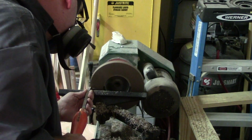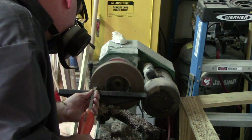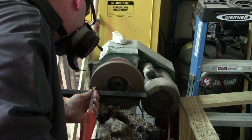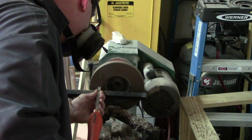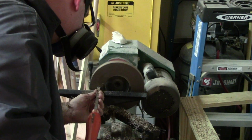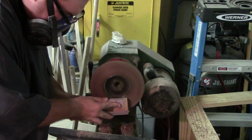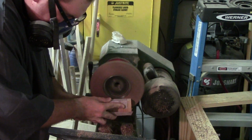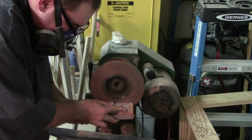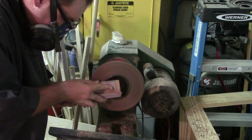And again, some of the rings I had to clean up, so I was facing off both sides of certain rings and trying to get those nice and flat. And again, using the sanding block after I used the flat carbide rougher to get a majority of the inconsistencies off each face of the ring. And then again, I use a sanding block to finish up those surfaces. At some point I had this down to a pretty good science where I could go through them pretty quickly.